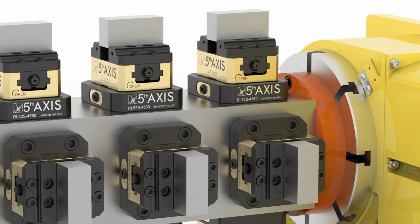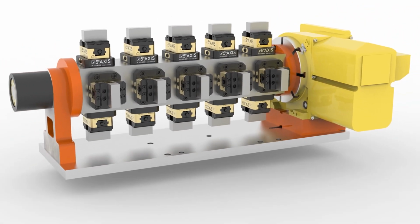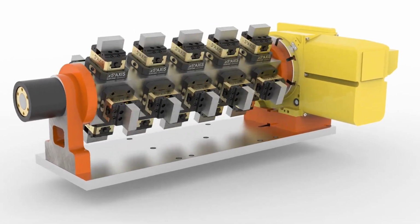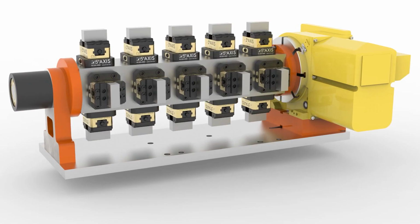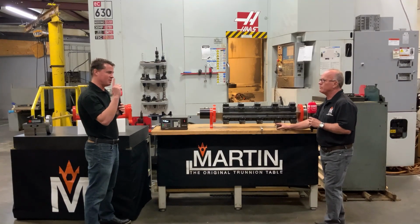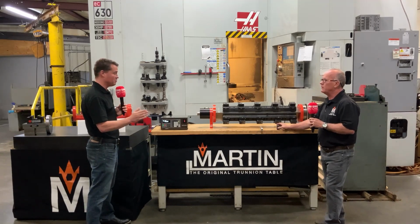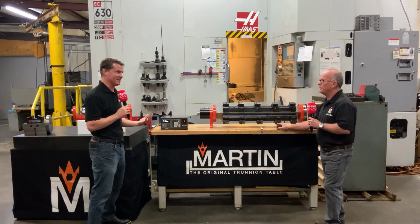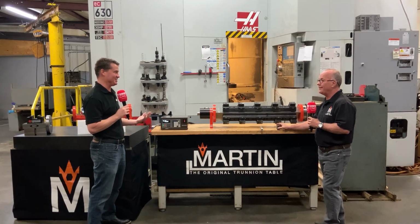I think they think about what we talked about a second ago, which was, okay, I've got to pick up my part, now I've got to flip it over, now I've got to flip it over again. But they don't think that it is actually a significant cycle time reduction to stick with one cutting tool for multiple parts before doing a tool change. And there are some great machines out there that can do a tool change in a second, or 3 seconds, or 2 seconds, right?